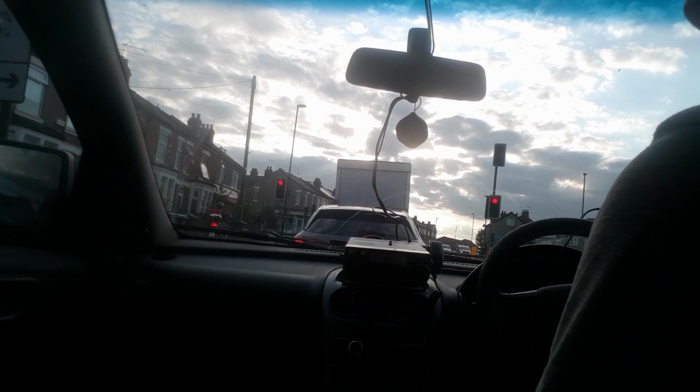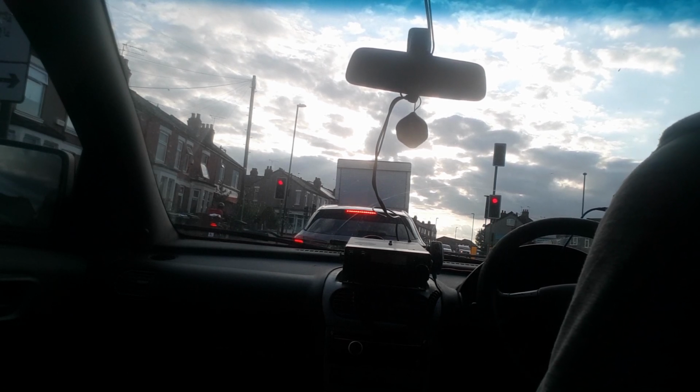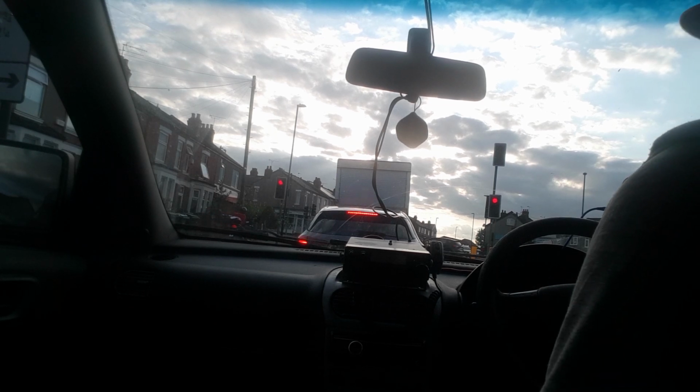Basically, I've cut down some Ultraflex 7 and soldered it straight to the antenna instead of using plugs. One of the reasons is because I've run out of plugs for the Ultraflex 7. I'll show you when we get to the hill, it's a lovely, beautiful evening. I've wrapped it up with tape, a good soldering job, and hopefully the plugs won't come loose, so you haven't got the plugs to worry about. I have brought my SWR meter, and we'll give that a try in a bit.